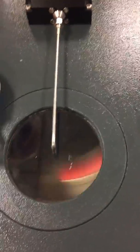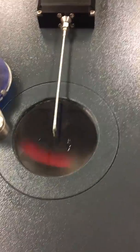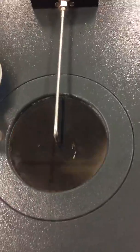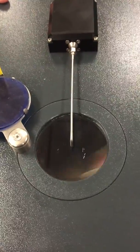Now they calculate how fast, how many RPMs it's going to travel before that metal pushes up the side and shoots out the spout. Because you don't want to do it too slow. You want to get to a certain speed before the metal leaves the crucible. Can you do it too fast? You can do gold too fast. It's going to damage the investment.